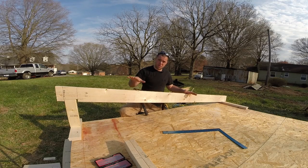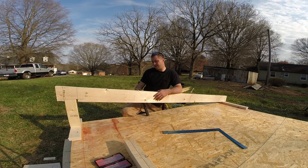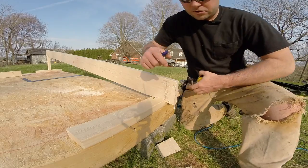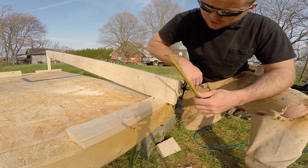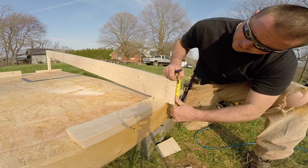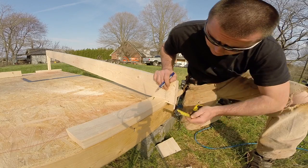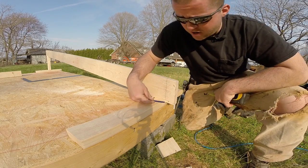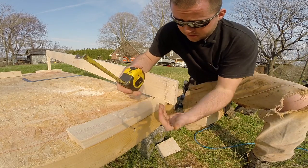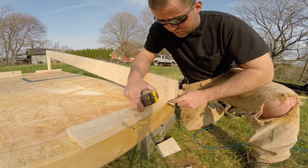At this point, if you're not happy with this pitch and you want something steeper, you can make those changes. Since I'm not dealing with a lot of snow here, I'm going to go with this as my pitch — until the next video when I change my mind because I thought about it for a minute. It is a little low. One thing I just noticed is that I'm going to do a 1x6 fascia on here and I also want to have a soffit in there. So if I hold a half inch for my plywood, let's go three-eighths because it's running on a diagonal, and measure down 5 and a half inches, that piece of wood would end up showing in my trim.